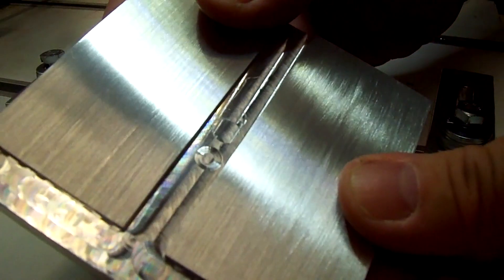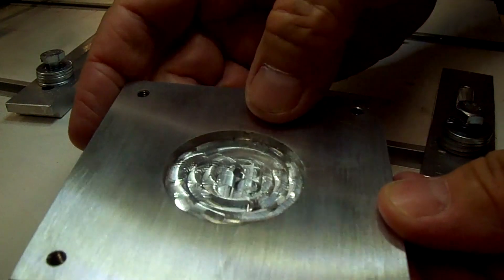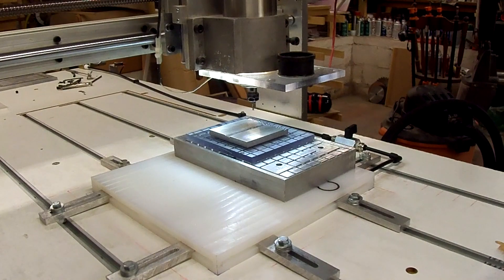No more hole. We've got Part C back onto the vacuum fixture now. Since we plugged that hole up, the vacuum is holding pretty good. The gauge is reading 27 inches of vacuum, so it can't get a whole lot better than that.